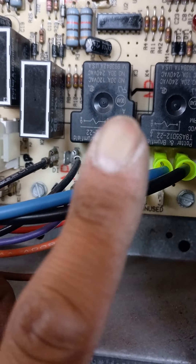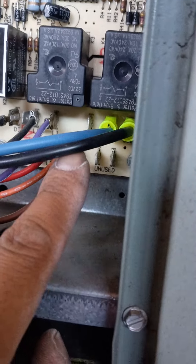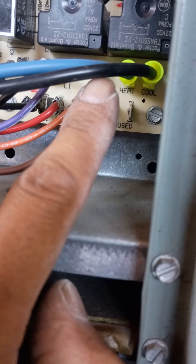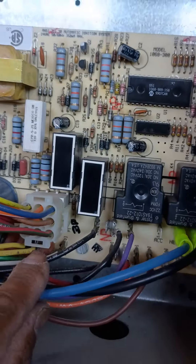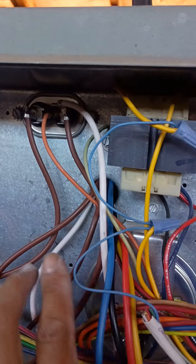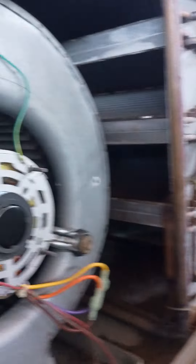But that's besides the point. I put it back on heating and cooling for medium and high — the third and fourth speed on cool and heat — and that actually goes directly to the motor through this hole here. So this one actually goes through here to the motor on the side, and everything's wired up. I already zip-tied everything here as you can see.